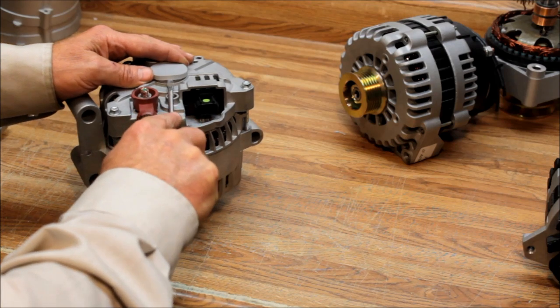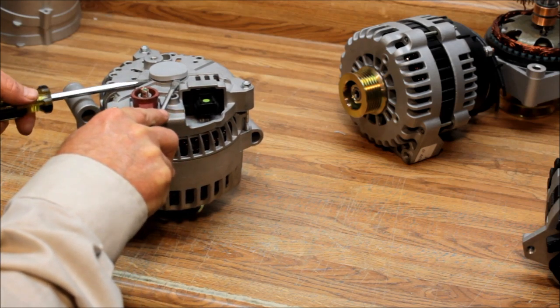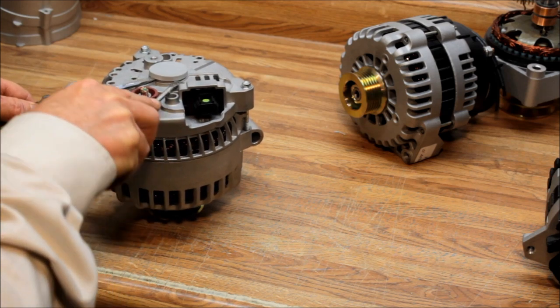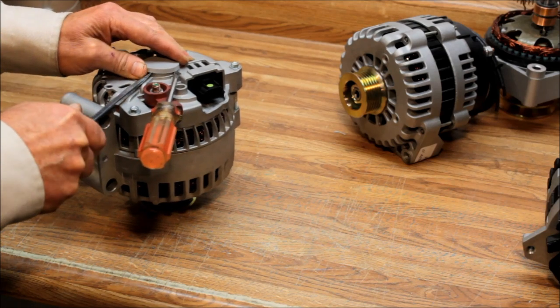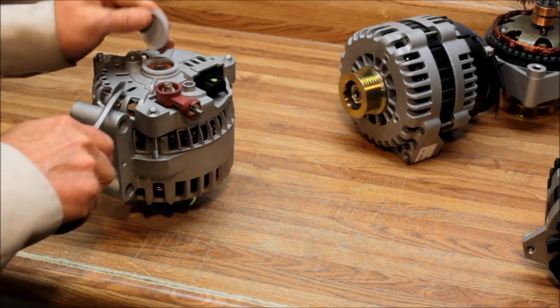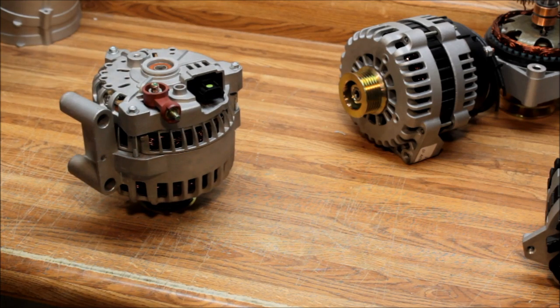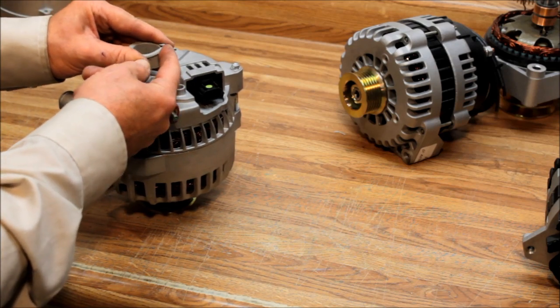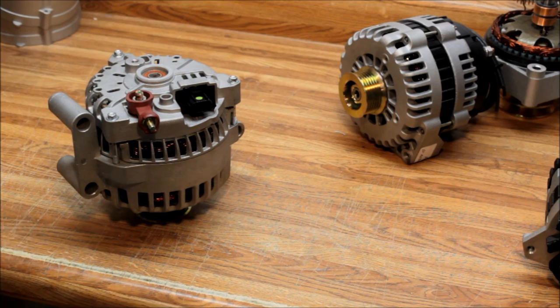The first step is to remove the rear plastic cover. Be very careful getting this cover off — if you pry up too much you can break the internal tolerance ring, and you don't want to do that. This cover snaps over the edge of the tolerance ring, so get it by the very edge and pry it up without breaking the ring. I recommend buying an extra tolerance ring when you get the bearing, because over-prying will break it.